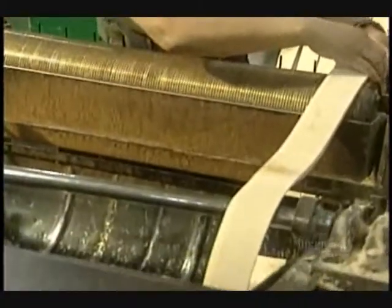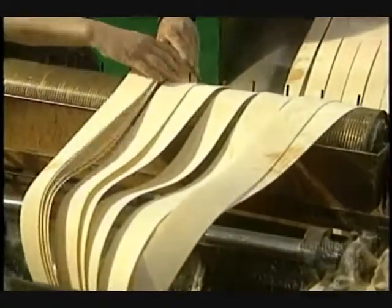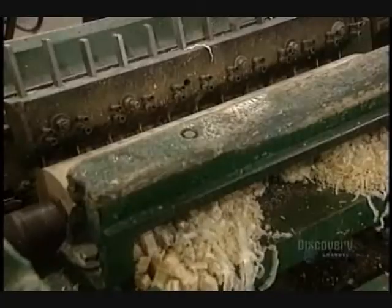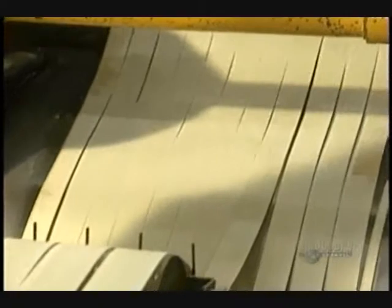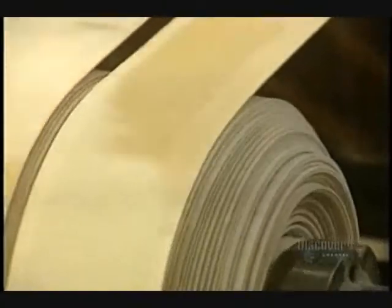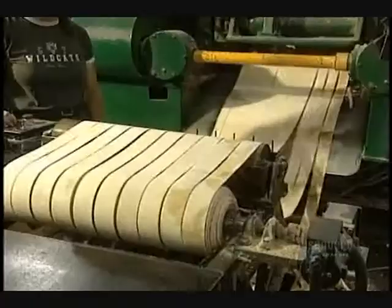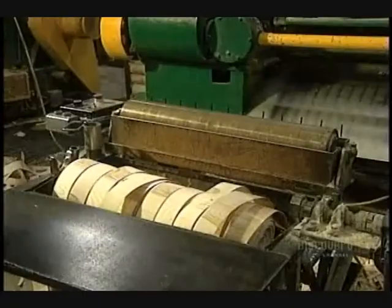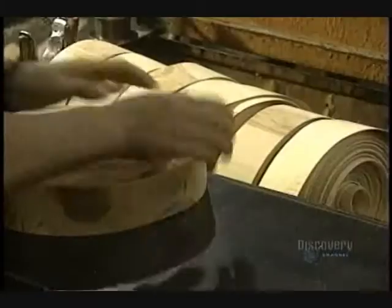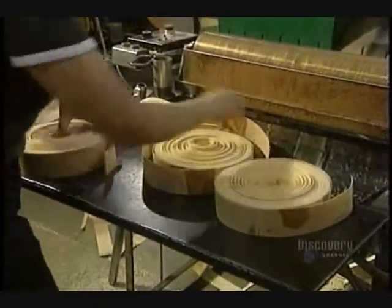Then these 12 blades, positioned side by side on the unraveling machine, will form rolls of strips called billets. These tiny cutters are used to trim the ends of the toothpicks. Knives placed here and there on the machine thin the ends of the toothpicks. The roller rolls out the cut strips, forming a billet. Completed strips, or billets, are taken out manually. Each billet weighs 1.8 kilos.